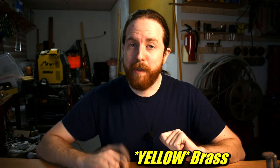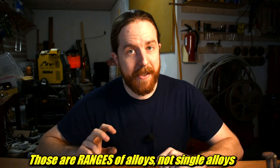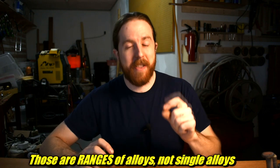Brass, which is copper with some zinc added in, I probably wouldn't bother scavenging that unless you're really careful, because door handle brass is different from plumbing brass, but not all door handle brass is the same. Not all plumbing brass is the same. And because we're talking razor thin margins here, you might not want to mix all the plumbing brass together. It might work, it might not. That's all I'm saying. You should probably just buy an ingot of the stuff, like this one.